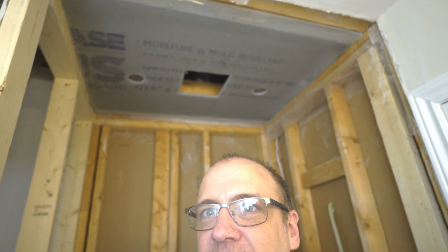I've been doing a little bit of head scratching. I've been trying to fit my rain shower into the ceiling and just see how the clips work and how it attaches. Couldn't get it to go. Rereading the instructions over and over. It says 218 millimeters. And I'm measuring and measuring. It's spot on. Circle, not a square. Says I need a minimum of 1/2 inch for the clips to catch, so the tile will take care of that, so I can just tile the circle over the square. But I thought I had it all figured out, and I didn't!